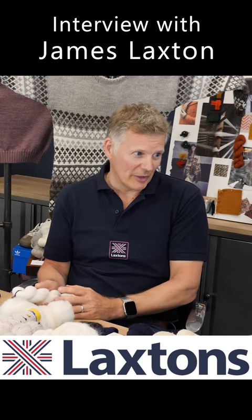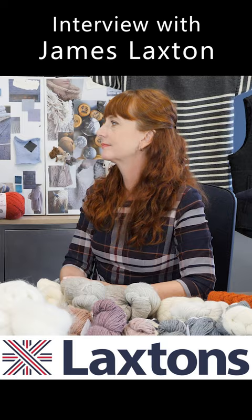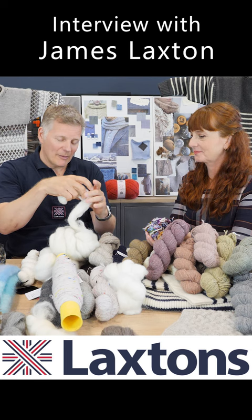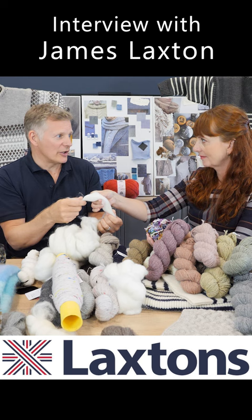How are we going to get the best out of the fiber? That's where our skills come in. We don't design around a yarn, we design around fiber. Every fiber has different characteristics and we have to get those characteristics out in the yarn. This is all the fiber waste that we make, reconstituted back into fiber — so in here there'll be mohair, wool, silk, alpaca — it's whatever's going through the factory at the time.